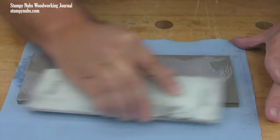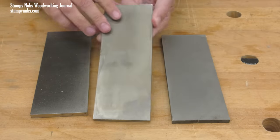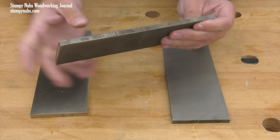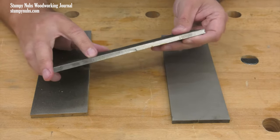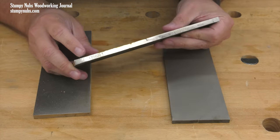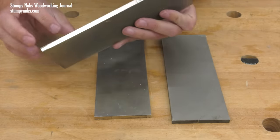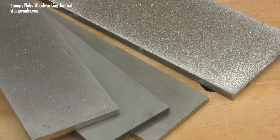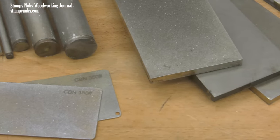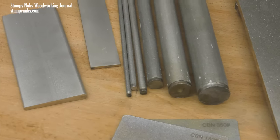I just spritz on some water and my Shapton is dressed in just a few seconds. Really, the quality of these CBN stones are superb for the price, but I do try to find something to complain about whenever I review tools. In this case, I find that the edges of the larger stones are a little sharp, especially on the coarser grits, because those CBN crystals go all the way to the edge. You could cut yourself. I solved that problem with just a little bit of sandpaper. If you want to check these out, give Ken a visit at his website, woodturnerswonders.com. I'll link to it below this video. Ken runs a small business with great people that are really worth supporting, especially with products like this.